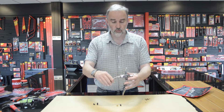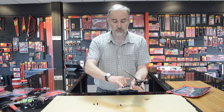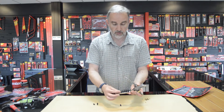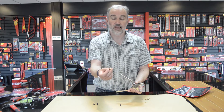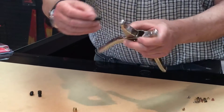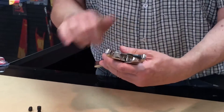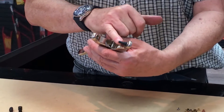There's the basic tool, and screwed into the handle you've got the replacement dies. These are the punch dies, and also in the last two slots is a brass anvil and there's the die that suits the eyelets. In one side of the tool, lightly screw in that size — it's actually the five mil punch.